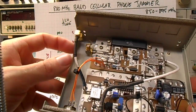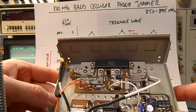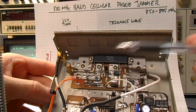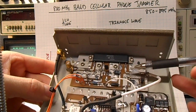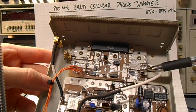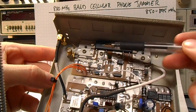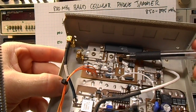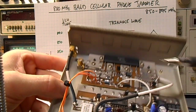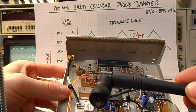The output of the VCO connects via a little SMA jumper up to a Hitachi PF0030 RF power module. I found this RF power module on an old Radio Shack analog cellular phone. It has a variable RF output between 1 and 8 watts and also has an improvised SWR protection circuit. If the SWR gets too high, it creates a voltage off the Schottky diode and shunts the power control voltage to ground. There are only 4 pins on the RF power module: RF input, VAPC (automatic power control), VDD (main +12V), and RF output — already set for 50 ohms. I have a TNC jack panel mount for the antenna connection, which you can sometimes get from old cellular phones.